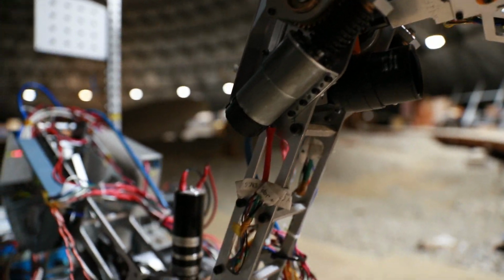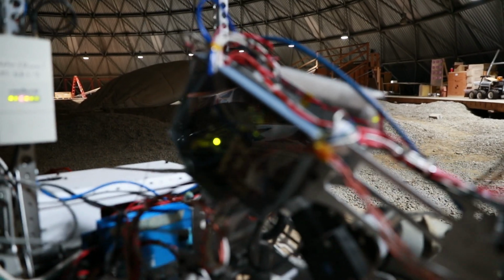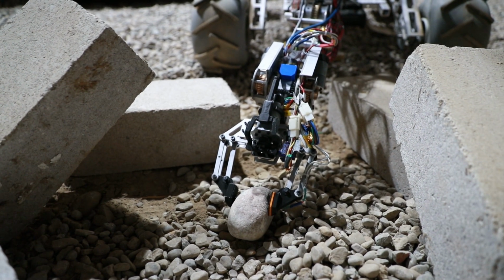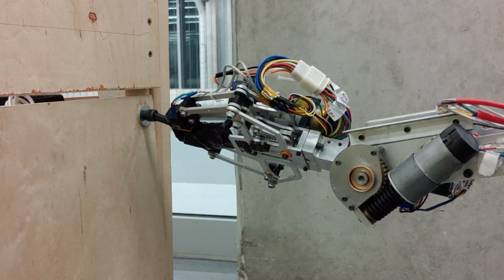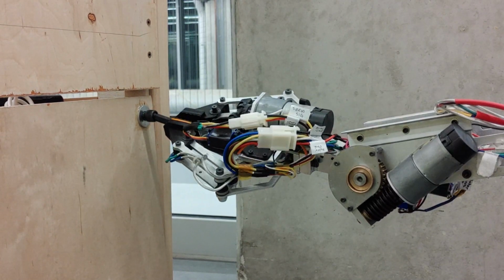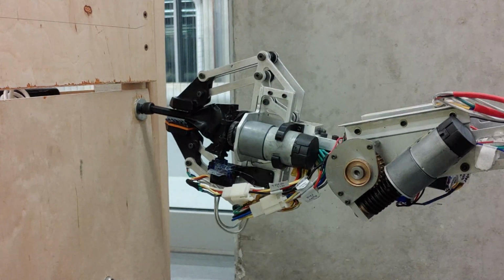We implemented linear actuators and worm-driven joints to reduce backlash. In doing so, a lightened design was created and validated through FEA without compromising on performance. This year's arm has 5 degrees of freedom and a continuous rotation wrist, which interfaces with a new end effector design featuring load sensing capabilities, achieved with a force-sensitive resistor and attachments, such as an Allen key tooltip to simplify